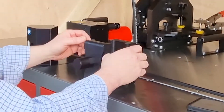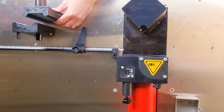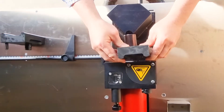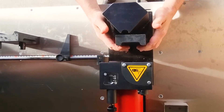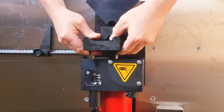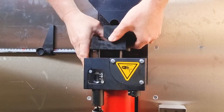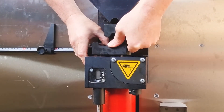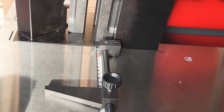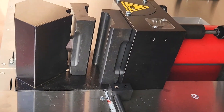Then we've got the feature of offsetting, and that's where we want to put a very tight bend in the bus bar. These are called offsetting shoes. You put this one in here like so, right back, then this one goes in there like so. You've got 12mm, 10mm or 5mm offsetting steps. Then you put your bar in, set whatever length or distance you want for your offset, and operate the machine.